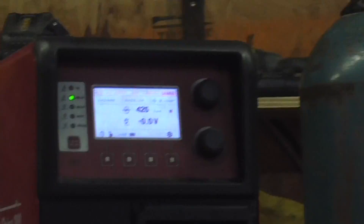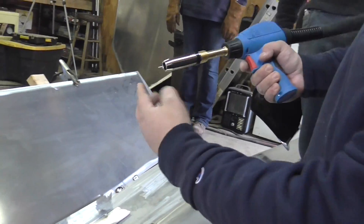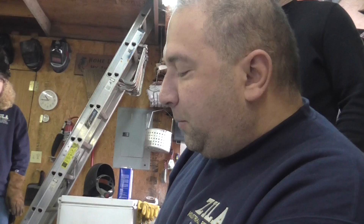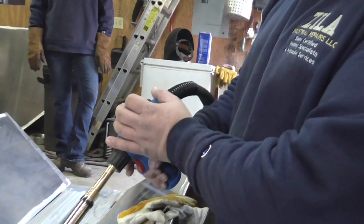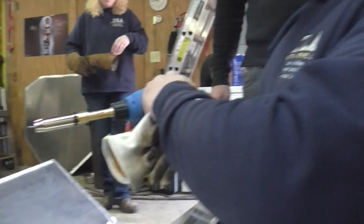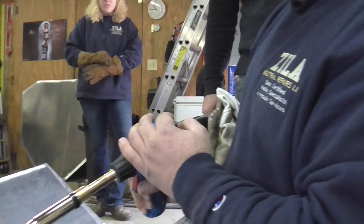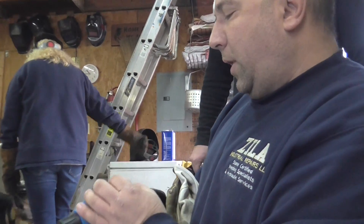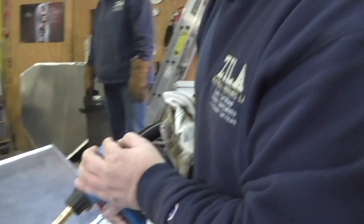So you start out at about 400 to 425-ish, then you weld. If you see it's getting too hot, weld with like three-quarters stick out at least. Then as the gap opens up and you see it's burning too hot, keep dialing it back — counterclockwise is down. So like at seven o'clock, that's where you want to start — that's about 425. When you dial it down you go to about 260-ish, that's around four o'clock. So between about 10 o'clock and 2 o'clock, that's kind of where your operation is.